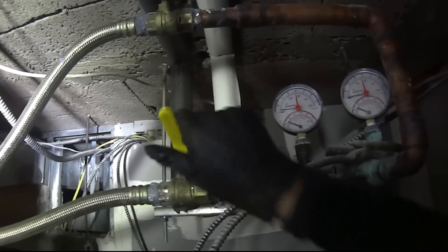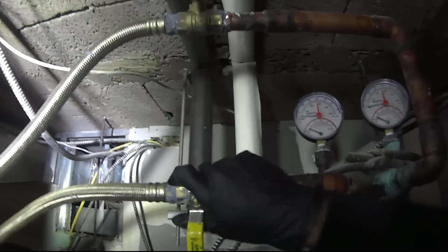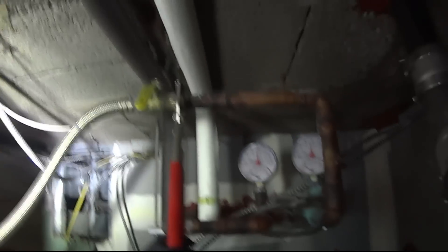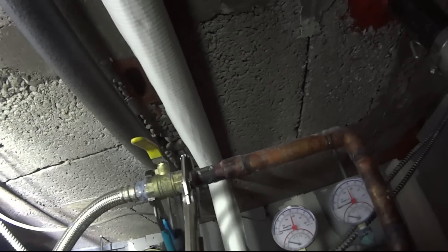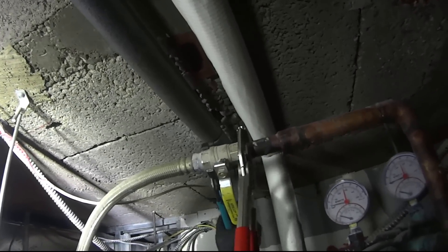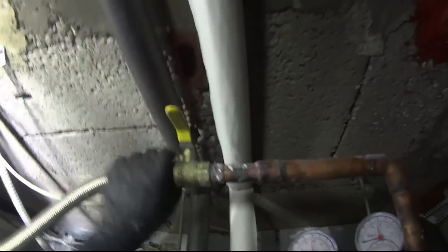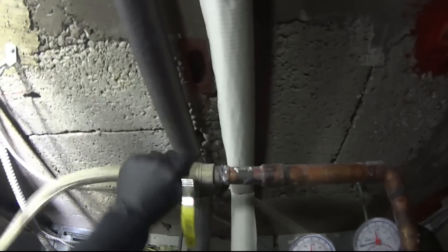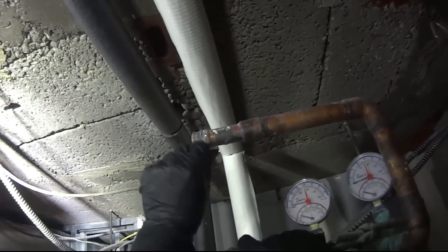This is the one that's leaking. This is actually the third or fourth case we've had like this in the past year. This building is brand new and they cheaped out. It's hard to see the hole because it's a tiny hole. We'll do the work out on the floor in the hallway. We're putting three new valves — US-made valves, not this Chinese crap. It keeps going bad. They put blue leak lock on this. It's ridiculous. Never seen blue leak lock like this. I don't like this stuff.